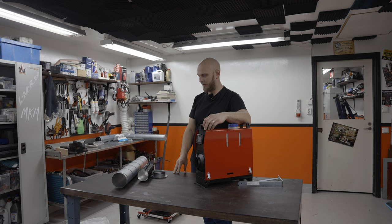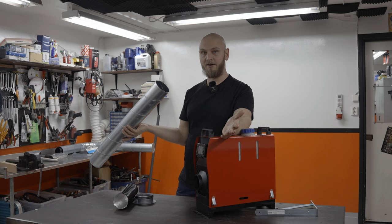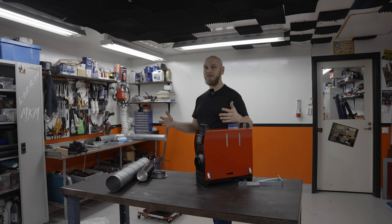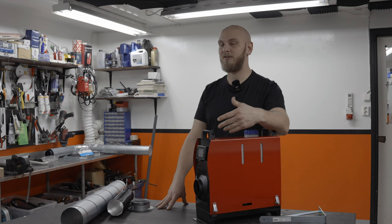And I don't think it's just going to work very well, especially not in the winter when this is supposed to be used, because it might be 20 degrees Celsius below freezing outside. First of all, I don't know how this thing would perform in those temperatures, probably not very well. And I would get a lot of condensation issues when the hot inside air hits the inside of this pipe, with 20 degrees Celsius below outside, and I don't want to insulate all the pipes because that would add too much to the cost of this entire project. So I'm just going to do what is tried and true. We're going to send the exhaust out through the wall. I'm sorry to disappoint some of you. Maybe some of you were looking forward to seeing this alternative, but it's not going to happen because of those reasons.